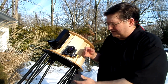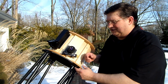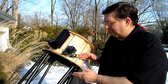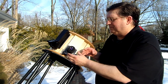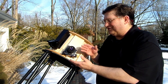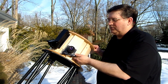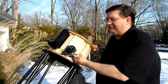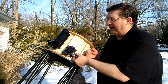The trick to cutting the truss poles is to use a nice saw with a stop so that you can cut them all to exactly the same length without any problem. So I got them all cut, put the telescope together, got the eyepieces in there, heavy coat on, and looked through all the eyepieces to see if they all came to focus. The trick is you don't want them to go in too far and you don't want them to come out too far — the focuser has about a two-inch travel on it, or a little more.